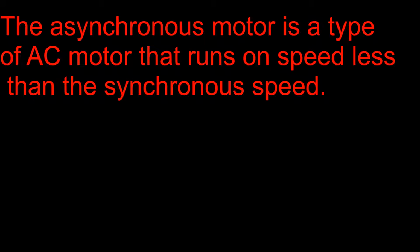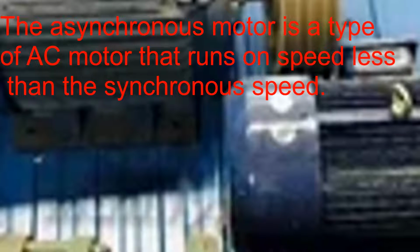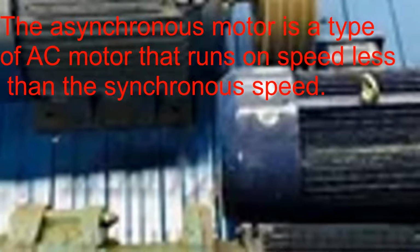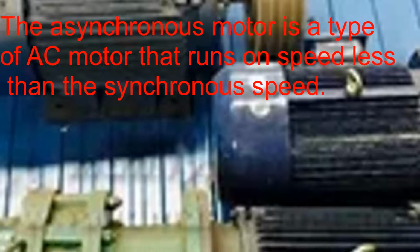As mechanical load is applied, the rotor slips back a number of degrees with respect to the rotating field of the stator, developing torque and continuing to be drawn around by this rotating field. The angle between the fields increases as load torque is increased. The maximum available torque is achieved when the angle by which the rotor field lags the stator field is 90 degrees. Application of more load torque will stall the motor.